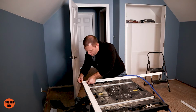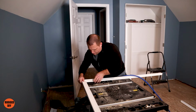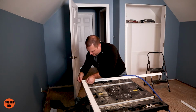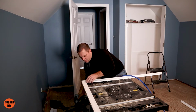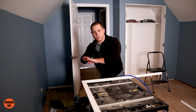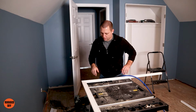And there's no way that you're going to get these pieces of trim, which are often kind of bowing, to perfectly align. But get them to align the best that you can, and just keep moving. Okay, now I put 2 finish nails in it just so that it doesn't kind of turn. If you put 1 nail in, it's going to wobble back and forth.